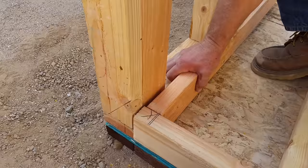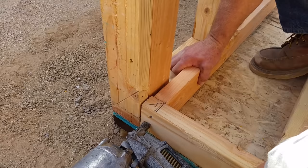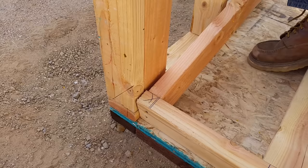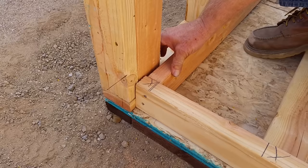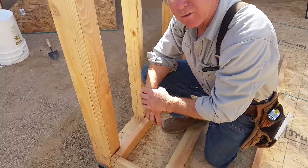I'm going to shoot that nail. That way, when I stand this wall up, the bottom plate will come into hard contact with the other bottom plate, and I can drive the nails over and suck the stud to the location — which also pinches the plates together, maintaining appropriate dimensions inside a system of partitions and walls.